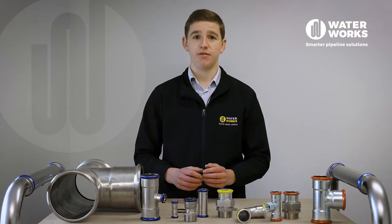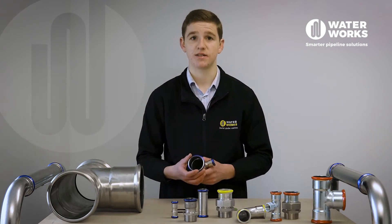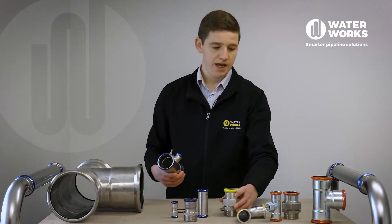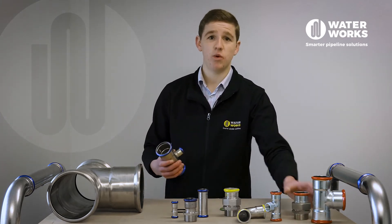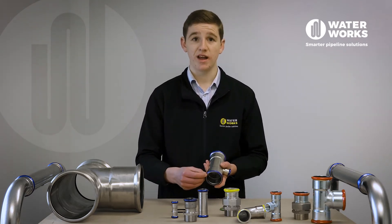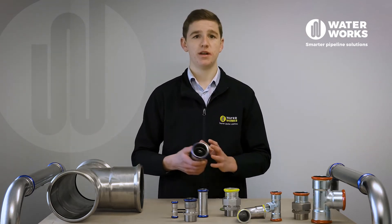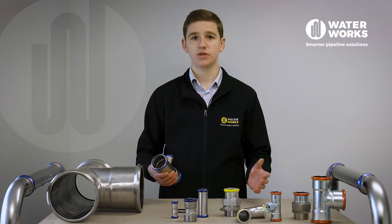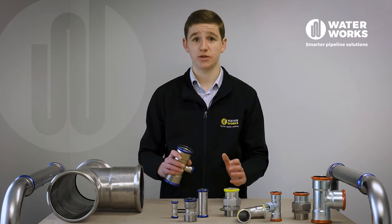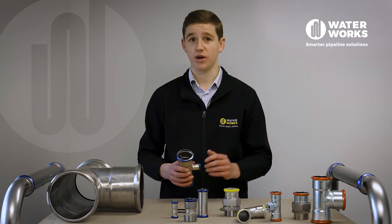On sizes up to 54mm, the Europress stainless steel fittings are fitted with blue press check indicator sleeves. Not only do these make the fittings easily identified from the stainless steel gas approved and carbon steel fittings, they are another quality control benefit of Europress. When you complete a press join the blue film will crack and the installer will be able to easily peel the sleeve off the fitting showing it's done. Once an install has been completed, the installer can run along the pipework and easily identify any joins which haven't been pressed because the blue sleeve will still be visible — another important Europress feature to ensure high quality installations.